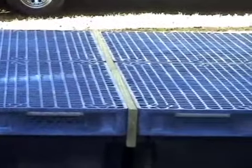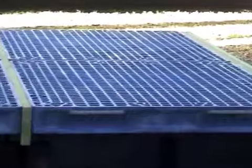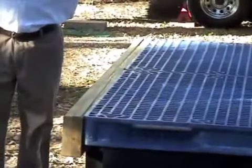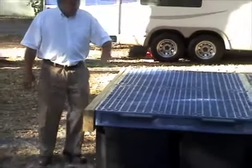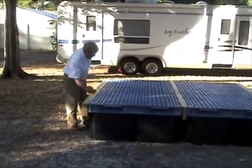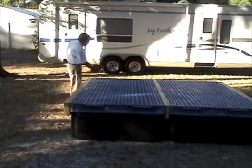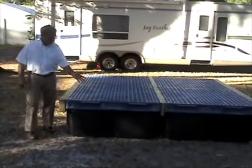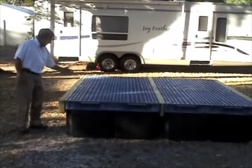What I need to do is make my own part, so we have some lateral loading. As you can see, there are nuts on the ends of either end that bring that threaded rod all together and laminate all the parts together. We don't have any box beaming in here, and there's a rod that travels through each one of the decks — three on each one. So a box beam needs to be incorporated. These rods also need to be registered on one-foot centers, so you have a rod every foot in these deck sections.